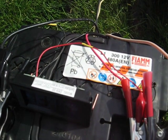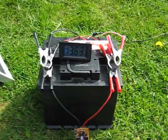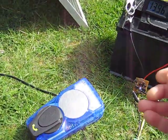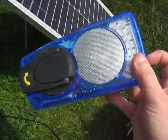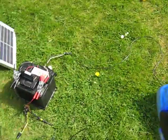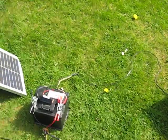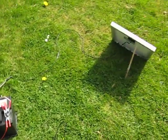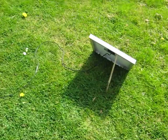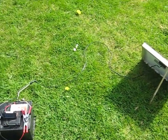I'm not going to show it because this is going to be embarrassing. We'll just wait for it to go into pulse width modulation, which it does at about 14 volts - and there it is. I'll turn it down a bit because it's pretty loud. The problem with not sorting out your radio frequency emissions like this is that the solar panel cable acts as an aerial, so of course it's transmitting quite some distance.